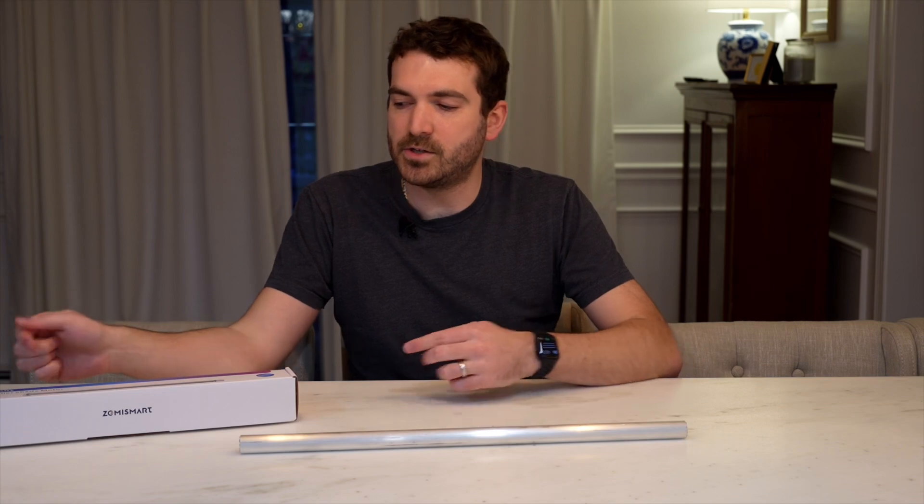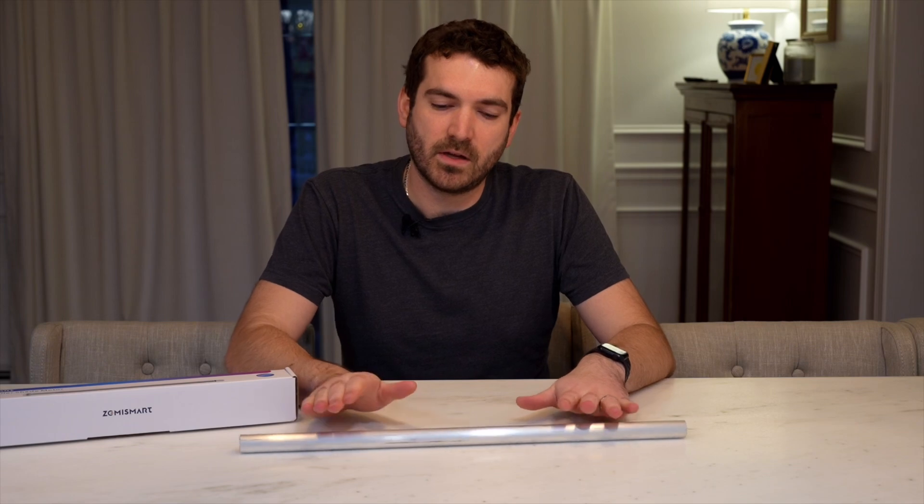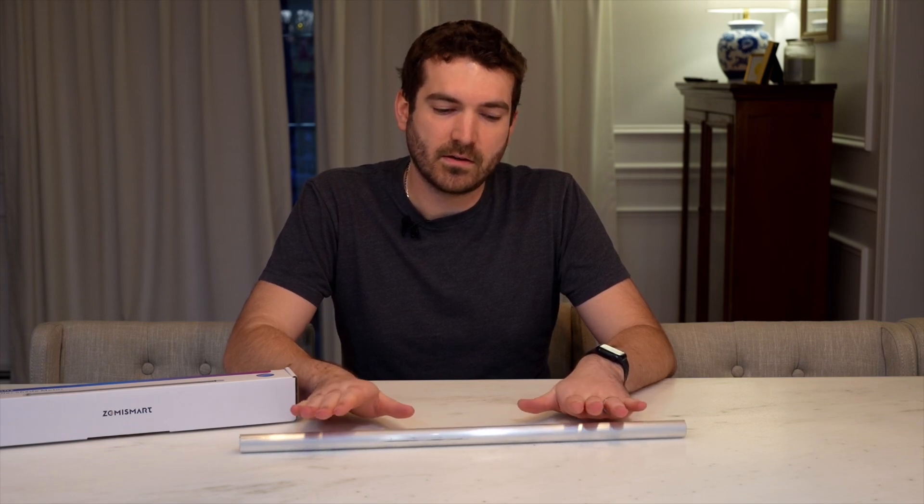One thing I wanted to point out about the tube: I did try looking at Home Depot. They had some steel conduit that fit this motor very closely, but you would have had to shave some stuff down on the motor, and it would have been a lot heavier than this aluminum tube. Getting four cut only cost maybe 30 bucks max — definitely more cost effective. In terms of connection, getting this motor hooked up to the Zigbee network was super easy. Home Assistant recognized it right away and understood exactly what it was for a shade going up and down. I hope this was helpful for anyone looking to convert their shade to a smart shade. Let me know if you have any questions, and thanks for watching.